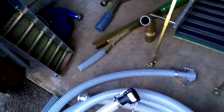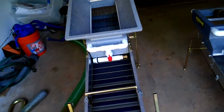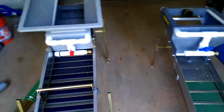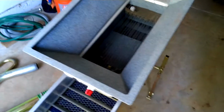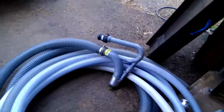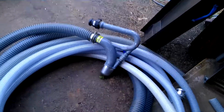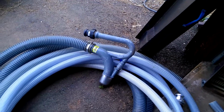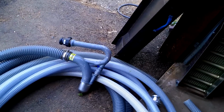One of the best things I did was the power jet and the swivel nozzle and the T80 air compressor. Even when you're using this little thing right here, that air compressor, diving and actually getting underwater, it's huge the amount of material more you can process. And with the 6.5 horsepower pump running a 3 inch, it has suction that you just can't believe. It's awesome. But lately, now that we can't dredge, I do the dry land dredge with a hydroforce nozzle, and the hydroforce is a lot of fun. It's kind of opened up a whole new world, so to speak.